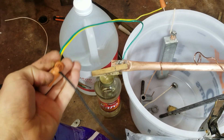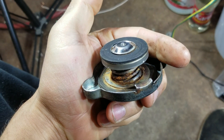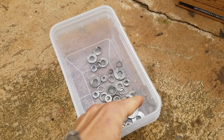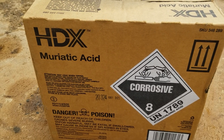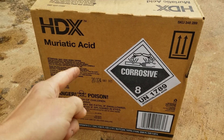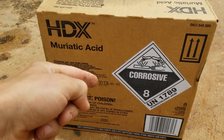We got our positive going to the anode, and our negative going to this, and then we're just going to suspend our parts like that and get them plated. Here's a before. Everything's got to be perfectly degreased and free of rust, because what you put into the process is what you're going to get out. I'm going to be using some muriatic acid — this is hydrochloric acid — to remove the rust, any kind of grease, and any kind of corrosion on any of these parts. Don't use this if you are not comfortable using it and don't know how to be safe with it. I'm not responsible — this is what I like to do and this is how I'm going to do it.